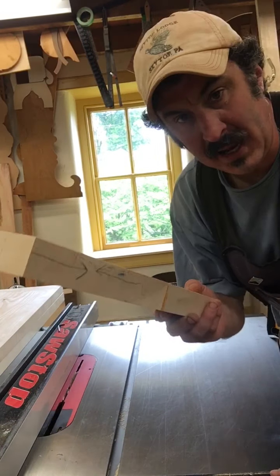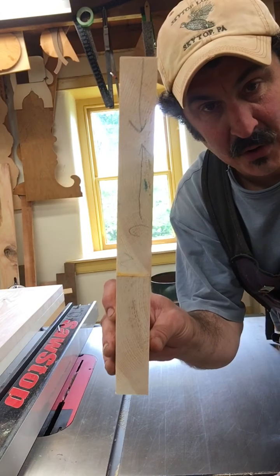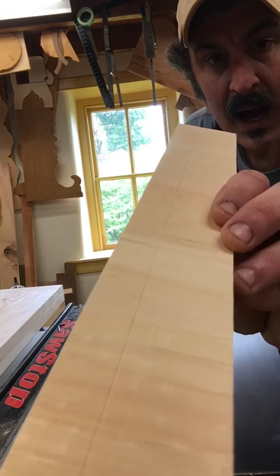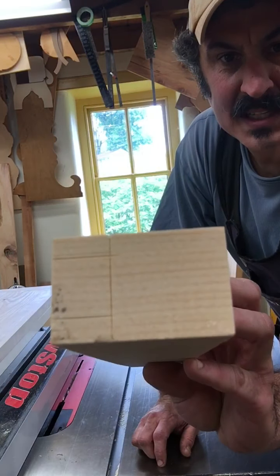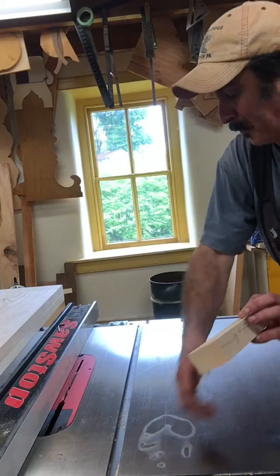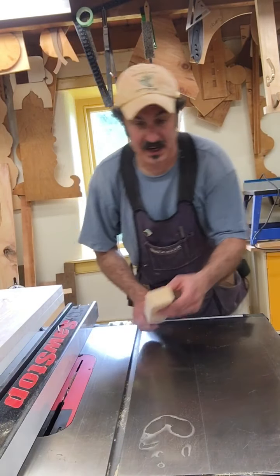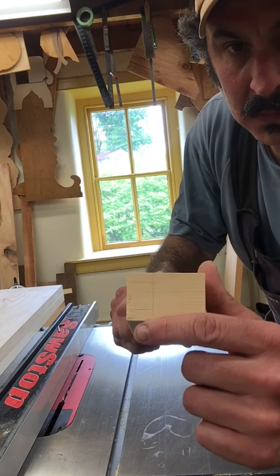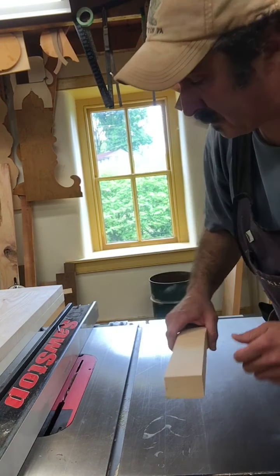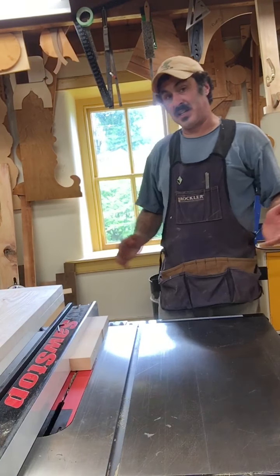I used the cut-off ends of one of the pieces here — you'll probably recognize that end we drew on there. I used my marking gauge and cut all along the edges to show where it has to be. You can see the lines to the tenon there as well. I raised my blade up to the height, going up to that line there, and I have it touching the line, so we'll check and see if it works.